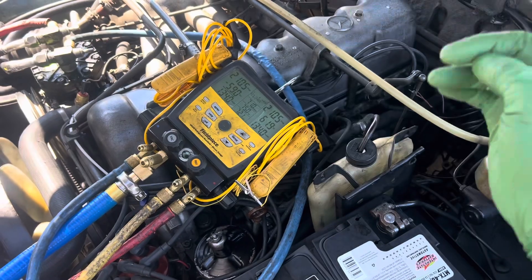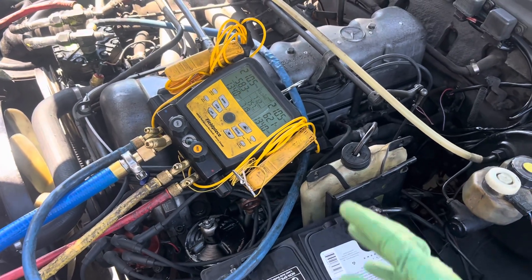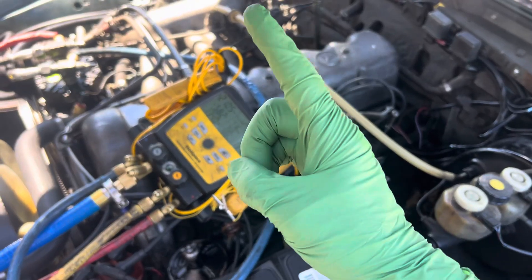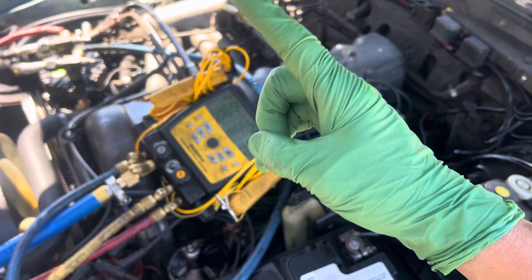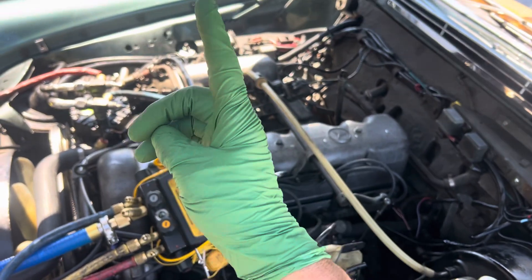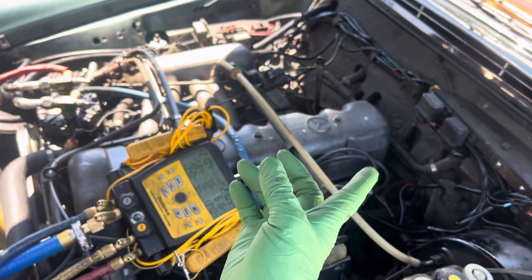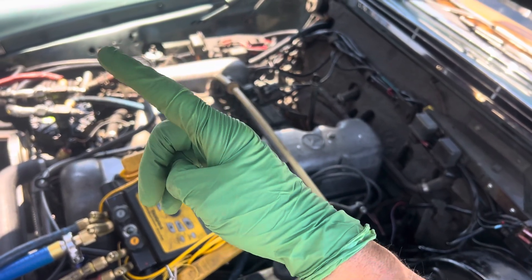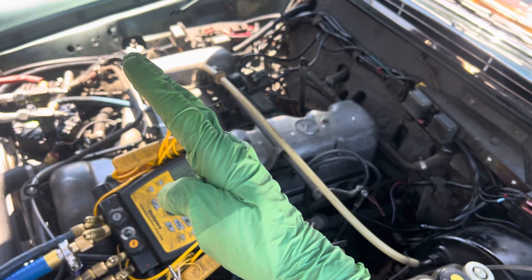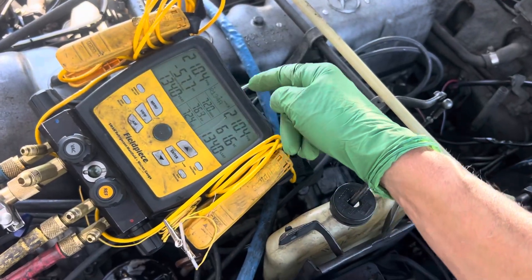But if you were on a pair of analog gauges up at 200 psi — analog gauges are only accurate within two to four percent depending on the manufacturer, and that was when they were brand new. And that is only on the center of their scale. So if it's zero to 600, it's only two percent accurate within a certain center range. As you get farther away from the 50 percent mark, your percentage of inaccuracy goes up.